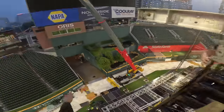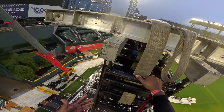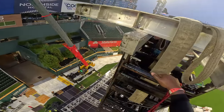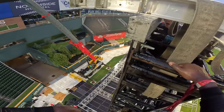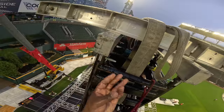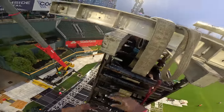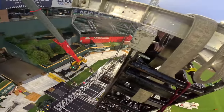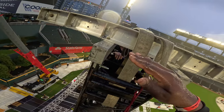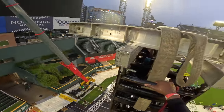And when you do it, make sure you do it away from your body, because sometimes if you do it in front of you, it blends in. He can't really see it, so make sure you do it away. And then if you're going to do it, do big arm signals. Don't do tiny hands. Chances are he doesn't see that. And if you do this or this, that means very slowly. So if you go like this or just this, he'll know to bring it down very slow and not at a fast pace where you can't catch it.